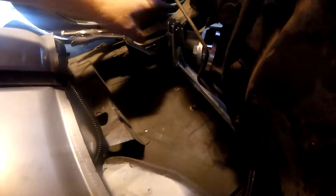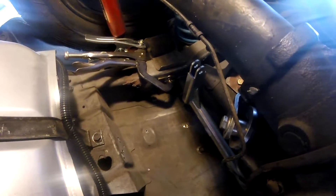Everything moves freely so now I'll go ahead and start welding it up — pop in a few more tacks, check it, then fully weld it up. One thing to keep in mind when welding this up: you have bearings in here, so you want to do about an inch or so at a time, let it cool down, go again, let it cool down, and weld again — so you don't overcook the bearings and the seal inside.